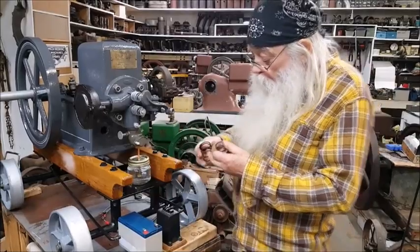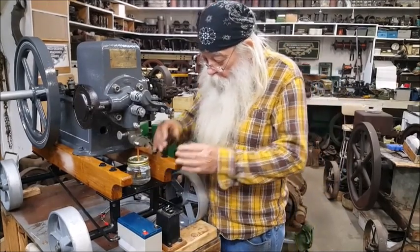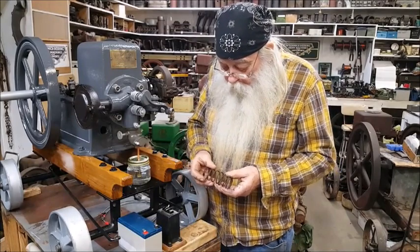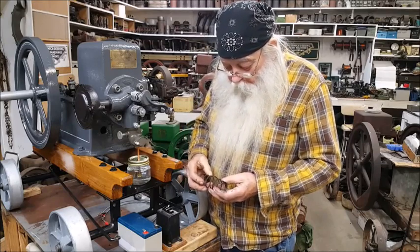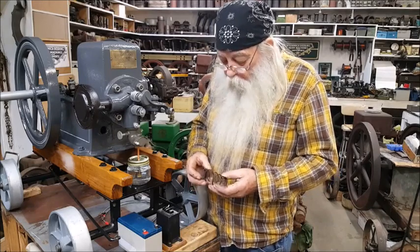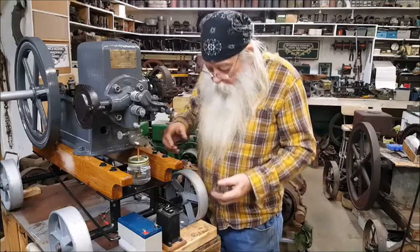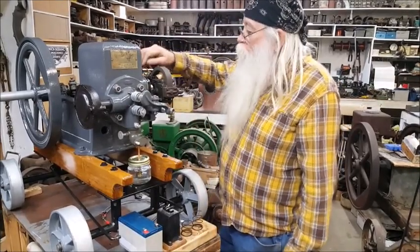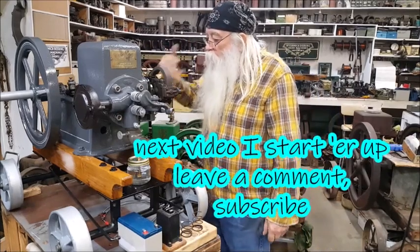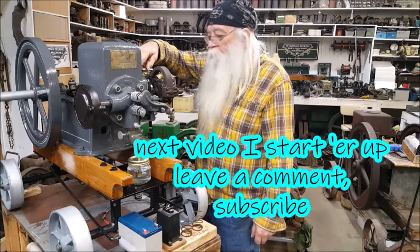We'll talk about this spring for a minute. The arbor to turn this spring on is one inch and some thousandths, but it's only seven coils. This is what is broke right there — one, two, three, four, five, six, seven coils. This spring would go up in there and push back on that to keep the push rod pushed back for the roller to ride on the cam, so that your latch-out can get behind that little adjusting plate on the side of your push rod. That's the way it works.